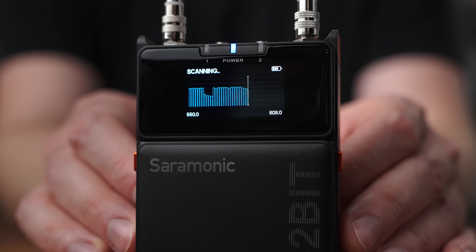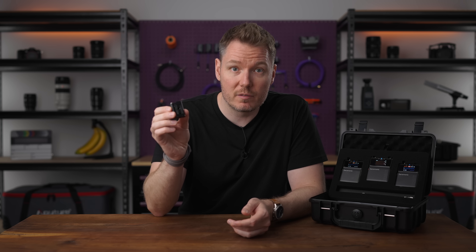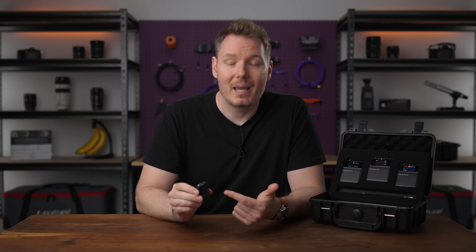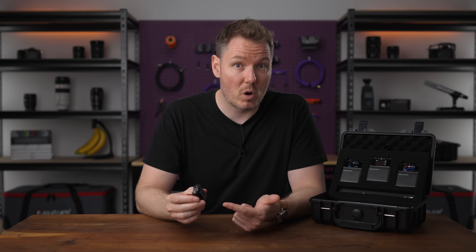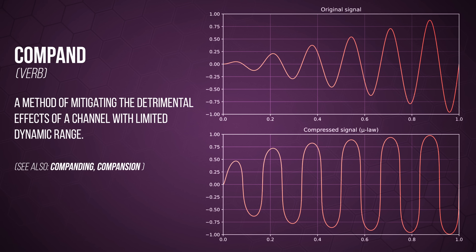Now, this isn't exactly new and applies to older analog systems as well. So let's turn our attention to the digital part of digital UHF. A high-quality 2.4 gigahertz digital wireless audio device can carry some distinct advantages over an older analog UHF model. Since the signal on these little 2.4 G devices is a stream of ones and zeros and needs to be decoded by the receiver, it can be encrypted, which prevents unwanted parties from listening in on your transmissions. And the transmission also doesn't need to be companded like it does with analog devices.